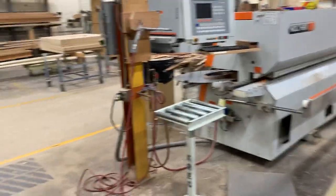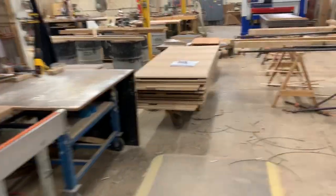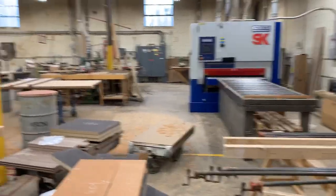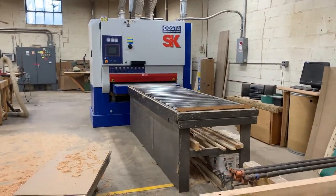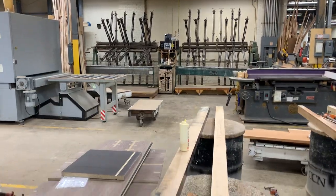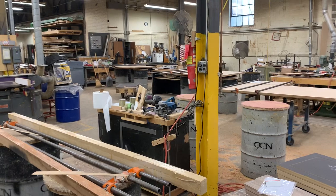The panels are proceeding down the line here. Once they are edge banded, the veneer edges on this side will be sanded through this three-head, 53-inch wide belt sander calibrated with a veneer platen on it — so we can, in fact, do our veneer panels. We also do lumber bands, and that's done on our clamp carriers by hand. We don't put the lumber bands on with the edge bander. We also do a lot of hand clamping of bigger panels that require lumber bands.